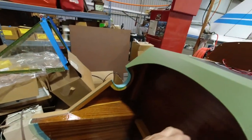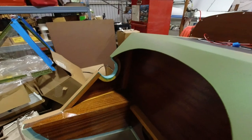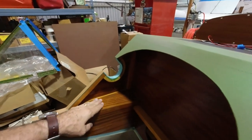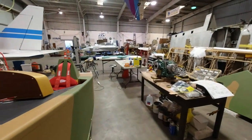I got those four standoffs made so I'll be able to get the engine in and positioned properly. It offsets an eighth of an inch. I'll get the holes drilled and located for the 3/8 bolts - they're AN6-50, more than ten bucks a piece. I was a little shocked when I looked that up, but it is what it is.